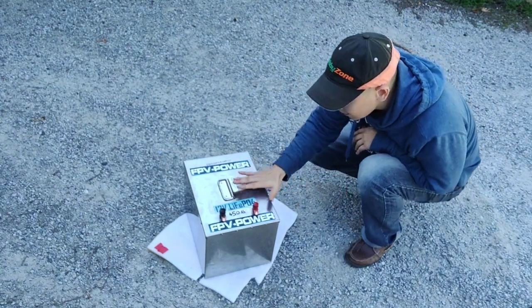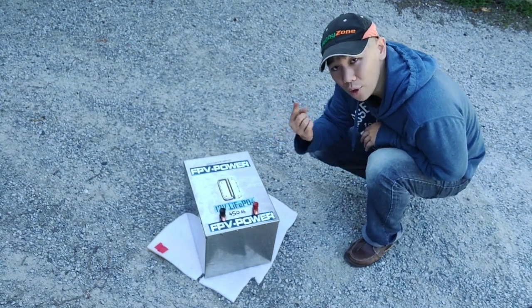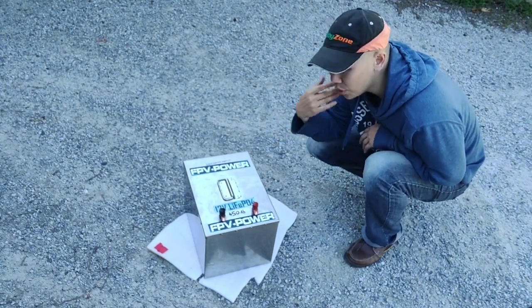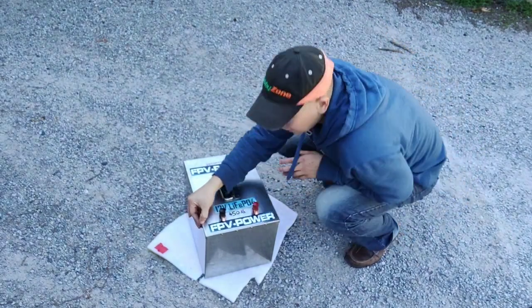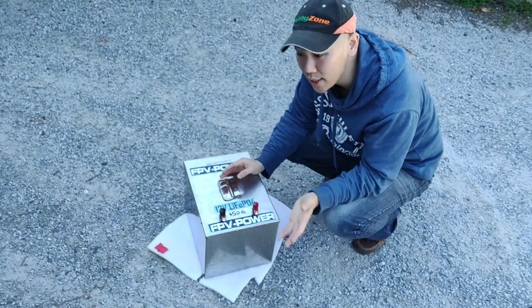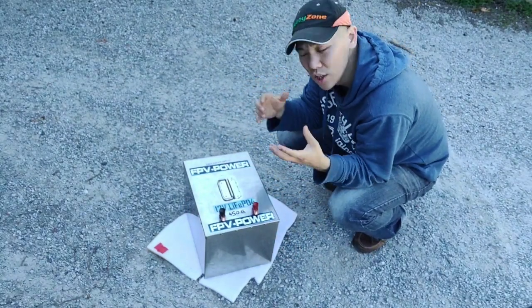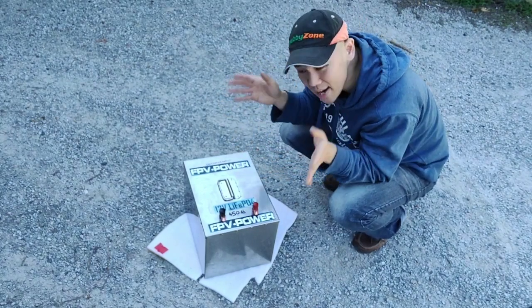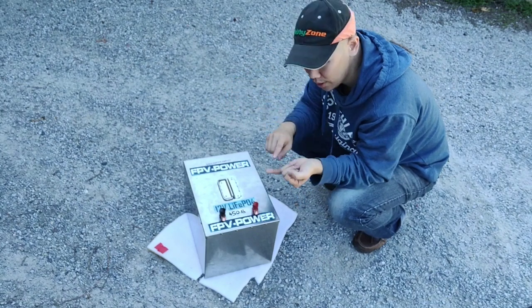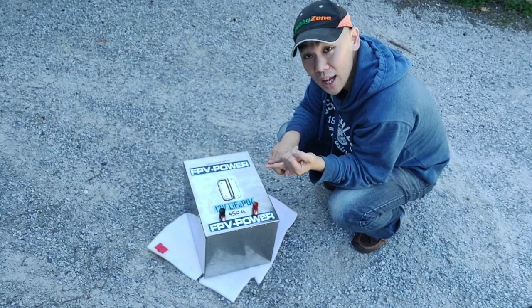Now, the customer on his motorhome has solar power. He has 500 watts of solar on his roof. I did explain to him that you're not going to get 500 watts; minus 25 to 30% straight away for the efficiency loss. So at 500 watts, minus 25 to 30%, that's the maximum you can get, and that's in a good situation where you've got a perfect cloudless day.